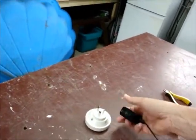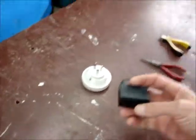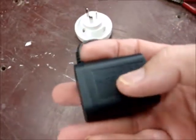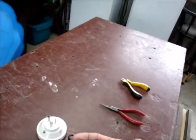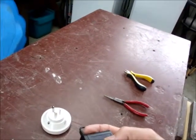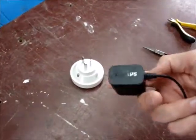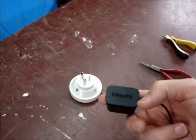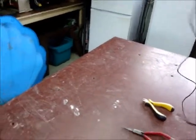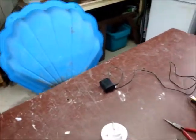So if you want to plug anything directly, you have to make sure that it has the universal voltage. It's almost impossible to read this writing, but if you can see it, it will say it's rated from 100 to 240 volts — basically it's self-converting. This is a charger for a Philips Electrical Razor. Most cell phone and camera chargers are also multi-voltage like that.